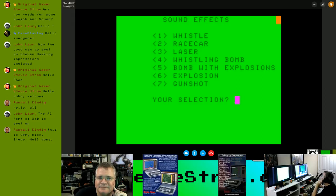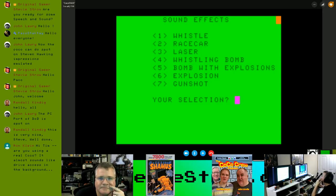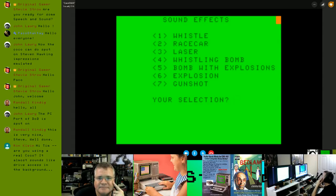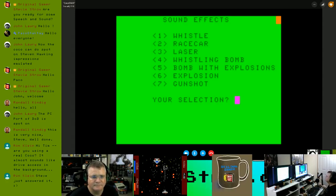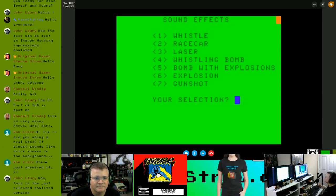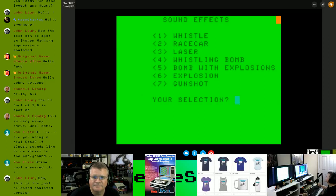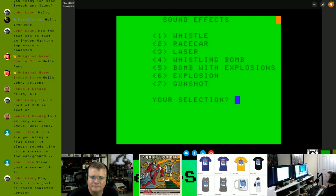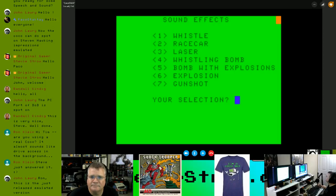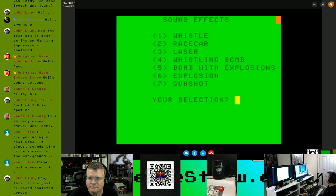Oh, and in fact, there's a project going on with the sound chip. They're making it better. They're going to be gathering up a bunch of different variations of the chip and extending the emulation a bit. But it's important to talk about the sound chip a little bit, because as you know, without a sound chip, the Color Computer has to direct the waveforms of the speaker constantly. The faster it does it, the better it'll sound, and that takes away from CPU execution, from game logic and displaying graphics and stuff like that. But with the sound chip, you're able to just give a frequency to the PSG, and it will produce the tone from start to finish at 44K. Which is cool stuff. And then all you have to do is change the frequency over time, and you don't have to pump out the waveforms.